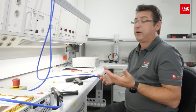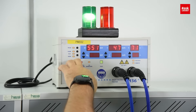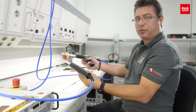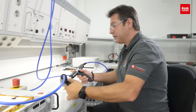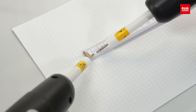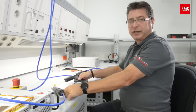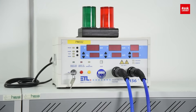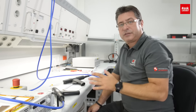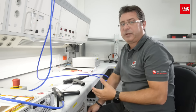I will start the generator now. At 2,000 volts — 2 kilovolts — I start at a distance of 1 centimeter, 10 millimeters, and as I approach we have a flashover at something like 2 millimeters, exactly as expected. Air, depending on humidity, can sometimes flash over even lower, around 1,000 volts.